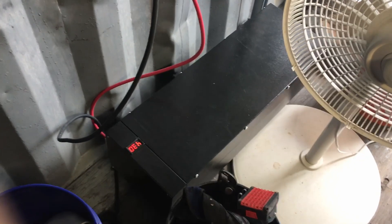The battery - I found it on eBay, found their website, called them. The battery is advertised as a 48-volt battery, even on their website. So I called them, made sure it's the LiFePO4 - that's fireproof, doesn't burn up. They confirmed it's 48 volts. The guy's English was pretty good but it wasn't his first language. Then I get the battery and I'm freaking out - it's at 42 volts. How the heck is it 42 volts? I finally get the thing charging.